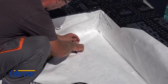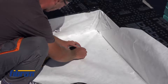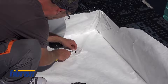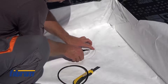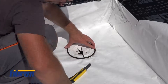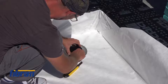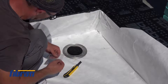After fixing the water-reducing layer, we cut out the position for the sealing ring, which seals the water-reducing layer on top of the additional part of the water outlet. The secondary outlet has a clamping ring with rubber that bonds the water-reducing layer to the secondary water outlet. The water-reducing layer is a secondary membrane — not real waterproofing, but it ensures water does not enter unwanted layers.